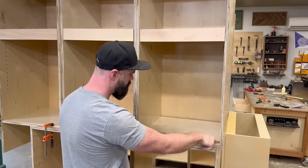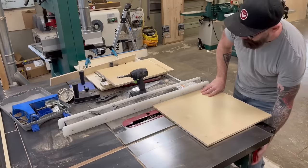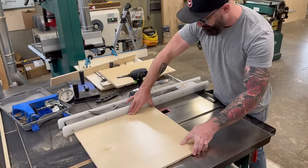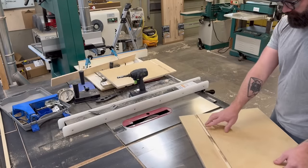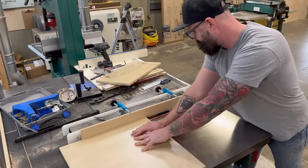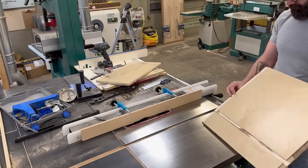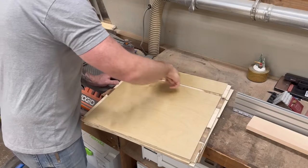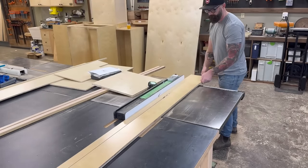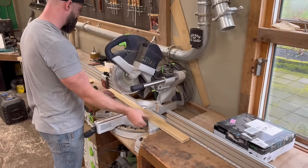The upper shelves were cut just a little less than the cabinet opening to fit on the shelf pins. For the lower shelf I cut the half-inch plywood exactly the width of the inside of the carcass for a nice tight fit. Then I took the top portion — one piece of half-inch pre-finished birch ply — and started creating an under-frame. I added a dado channel towards the back of the panel about four inches in from the back, then added a rabbet on both sides.